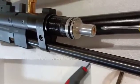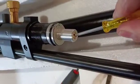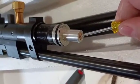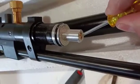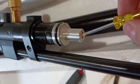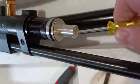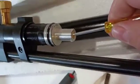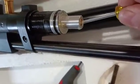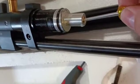If you want to increase the pressure in your regulator, turn it counter-clockwise — about a quarter turn. The very max you're going to turn it is a half turn, so the opposite side is pointing where it was originally. That max is somewhere around 180 bar. Half that much gets you around 160 bar, back to where it was is 140 bar, and if you want less pressure you can turn it the other way — no more than half a turn down — somewhere between 80 and 100 bar.